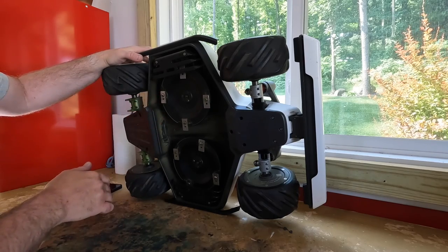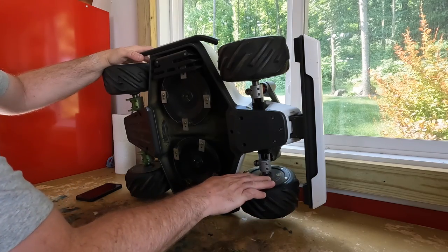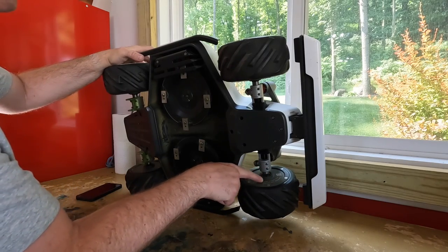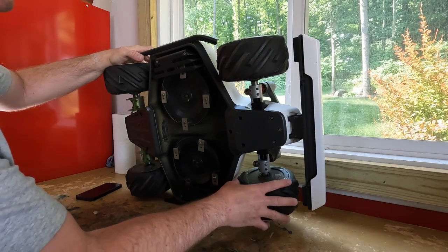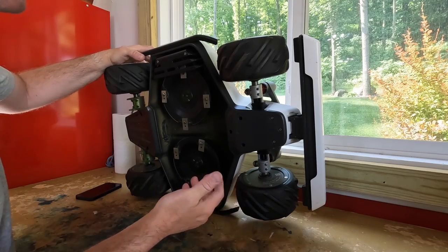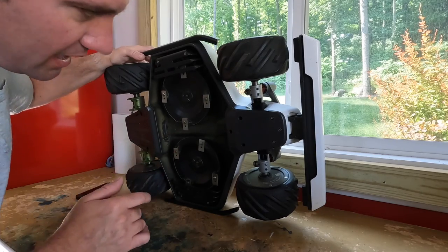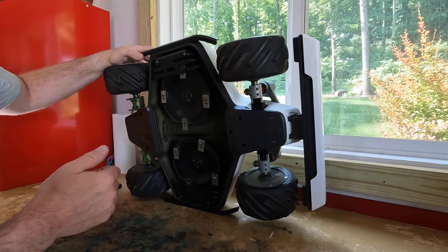The underside is cleaned up, debris knocked off. The motors are sealed in each wheel hub — 24 volt, 80 watt — that's the type of motor. I haven't looked to see if you can buy replacement parts for this. Basically it's sealed up at the hub, and leaving it sealed is often better than opening it up and exposing it to the potential of contamination.